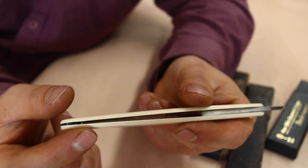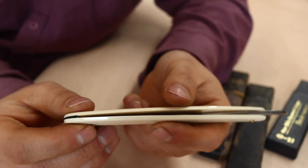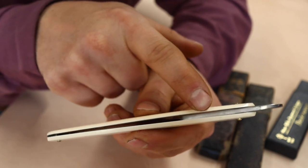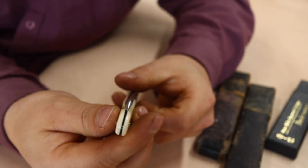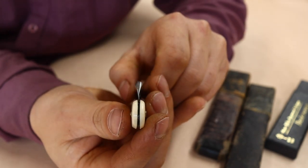It's a two-part construction, pinned at the front and the back. We have a wedge here, because you see it has to go from closed to open the width of the tang, and then it has to close back here, because this is where your straight razor blade wedges in.